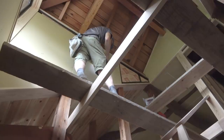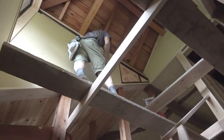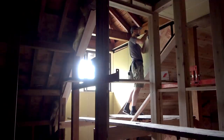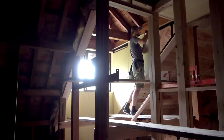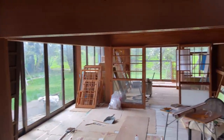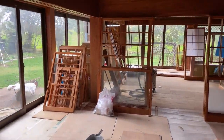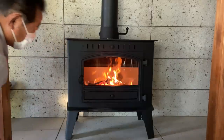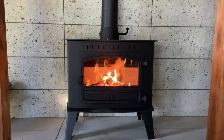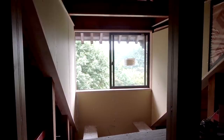Now the effectiveness of this insulation will be greatly reduced if the windows are single pane. So all new windows are double glazed, but we have left a lot of the originals in place mainly for budget reasons, and will likely replace these down the track. We will be using shoji — the paper screens — though as they're just thin paper they obviously won't provide much insulation, but hopefully they'll keep the draft down. For our main source of heating, at least initially, we plan to use a wood-burning stove complemented by space heaters. A lot of people have suggested heated floors, which would have been nice, but my wife was not so keen on them.